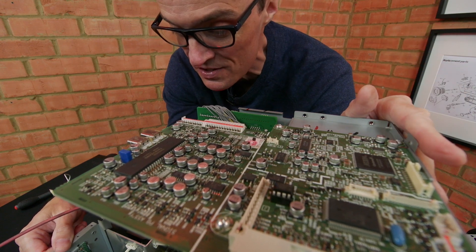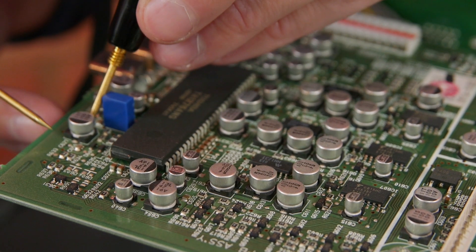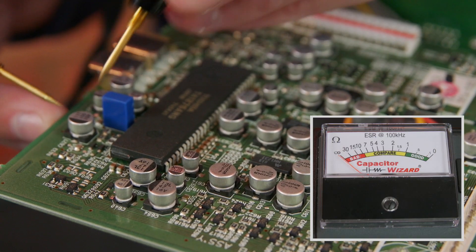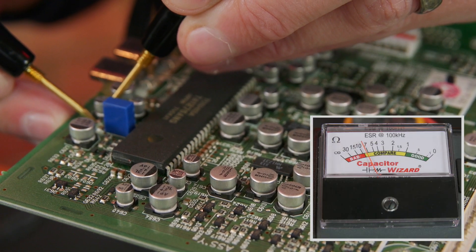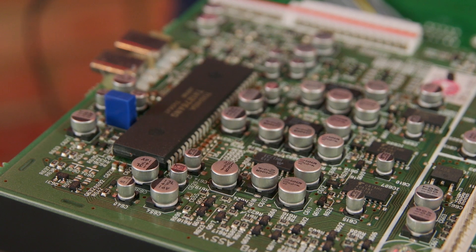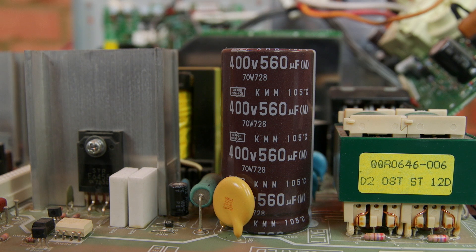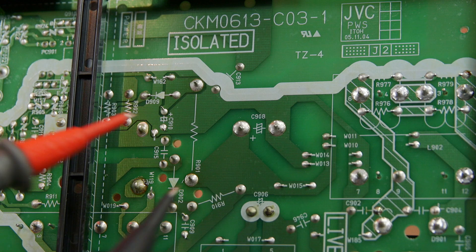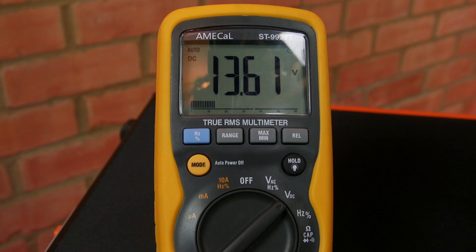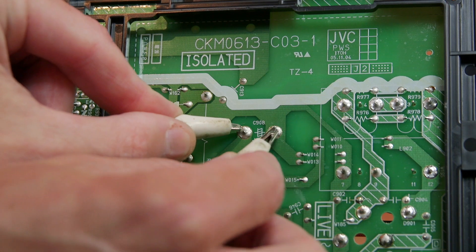However, whilst we've got the thing in pieces there's an opportunity to test them with my ESR meter. The surface-mount caps on the signal PCB and the large-value caps check out okay. The smaller one and two microfarad caps show 'compare' on the ESR meter. I don't think they're bad as you don't get great readings from small-value caps, but I'll order up some replacements and change them at a later date. Moving on to the main PCB — another word of caution: like the tube, capacitors can retain charge after the power has been removed. I first checked the voltage using a multimeter and there's only about 14 volts, which isn't a hazard to health. However, charged capacitors can damage the ESR meter so they should be discharged by shorting out the terminals.